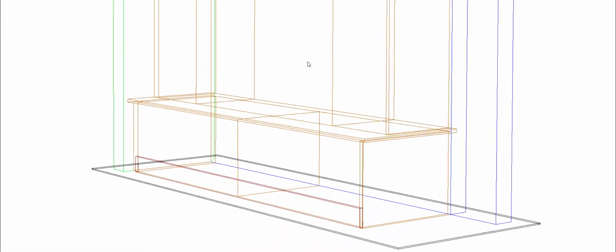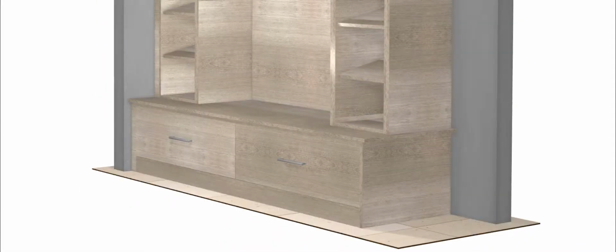So down here, same idea down here. We have this open shelf here for sitting. And before you email me asking if it's strong enough, it's 3/4 inch plywood cabinets, people. You can put an elephant on there. It's not going to break it, especially when you attach these things to the wall. I mean, especially with these built-in fillers or toe kick, it's just amazingly strong. We used to build these things for our work benches when we used to assemble and install cabinets back in the 90s and 2000s.